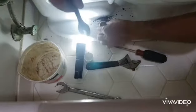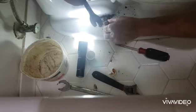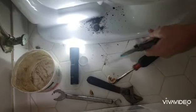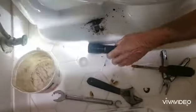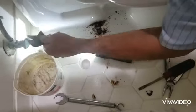It's not going to come off — that's just the cap bottom. So this one here is certainly not going to be cooperative. We're going to remove the washer and just pull the toilet up past it. Let's not forget to disconnect the water line.